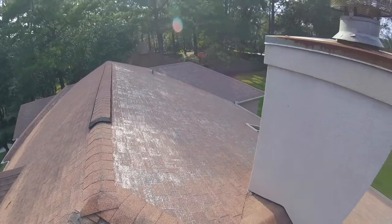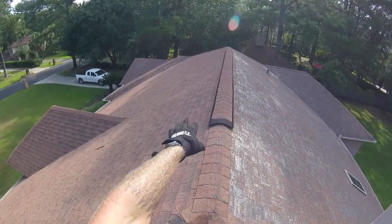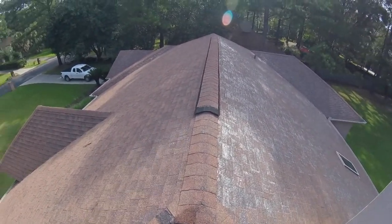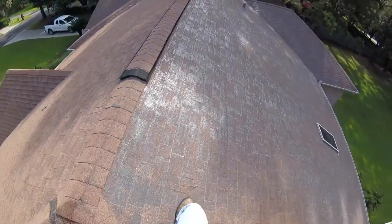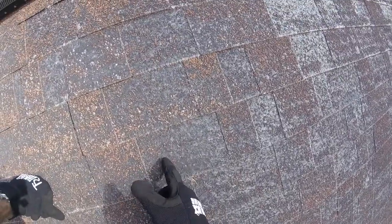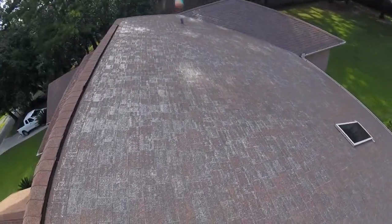So now this will give you a good illustration — I don't know that I've ever seen a roof this bad. Standing right here, you can see that this north-facing side has a decent amount of granules on the asphalt. But this side here has almost no granules whatsoever, or asphalt for that matter. It is so burnt up that it is literally just fiberglass up here. There is absolutely no granule coverage, no asphalt — that is just fiberglass. And that's going to be common all the way across this back side.